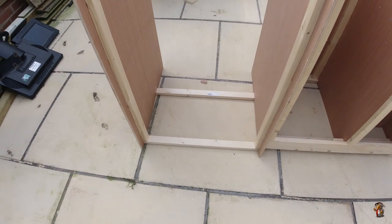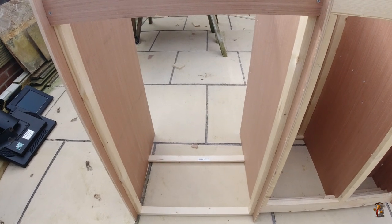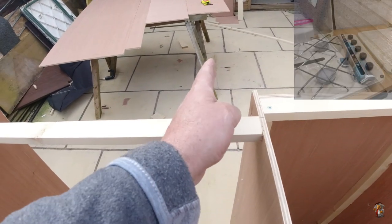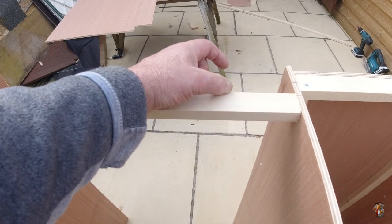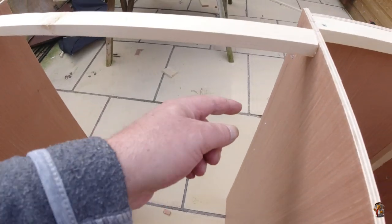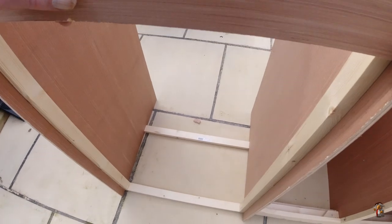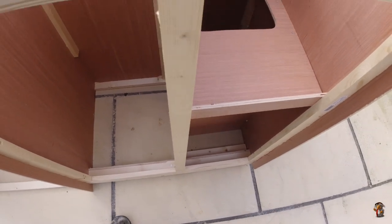That slot is for the drawers and that's the oven. I still don't know whether to put a drawer or a cupboard in the bottom — I'll lose a lot of space at the back of the drawer because of the door posts. I'm not sure how deep it's going to be because of the inch-and-a-half step. The sliding door opening is 16 inches from that end, only an inch and a half in. That piece has to be scribed to the door post, just like I had to do when I built the one that's already in there.